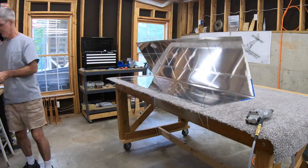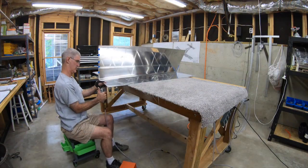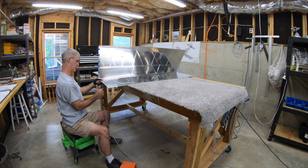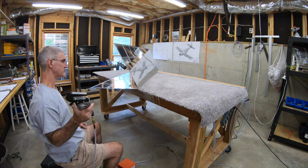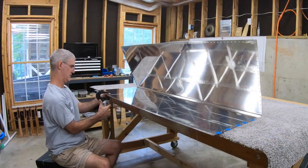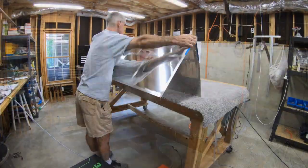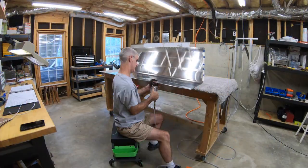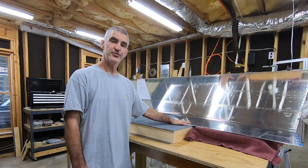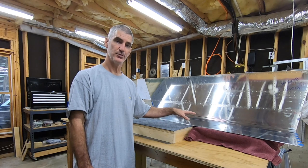Just being a little paranoid. This is a perfect case for the little roll-around stool and the foot pedal on the squeezer — it makes everything go really smoothly, comfortably, and quickly. Just cruising along, doing both sides of both skins. I've now dimpled all the holes in the horizontal stabilizer skins around the perimeter that I can reach with the pneumatic squeezer.